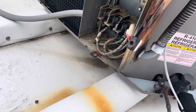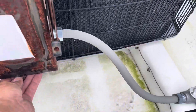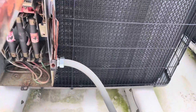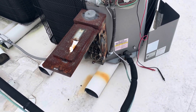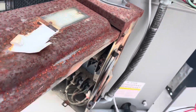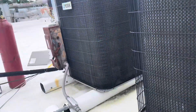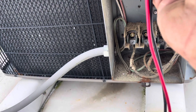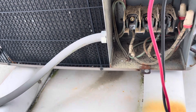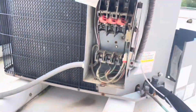Who the hell pulled the fuses out of this? This one's got its fuses. Who, in the name of God, pulled the fuses out of this thing? Let's see if we got power. This unit worked a couple weeks ago and had all its fuses because we were just here to diagnose that unit. Our power comes in here to the top of the disconnect. I don't think we have any power there either. Yeah, we have no power coming to the disconnect either. So someone pulled the fuses and killed the power to it.